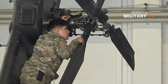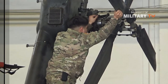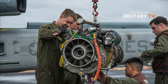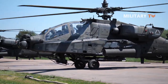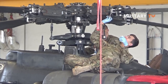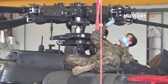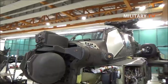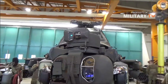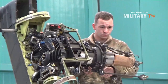An Apache has double tail rotors, each with two blades. The newest Apache sports twin General Electric T700-GE-701C turboshaft engines, boasting about 1,700 horsepower each. Each engine turns a drive shaft, which is connected to a simple gearbox. The gearbox shifts the angle of rotation about 90 degrees and passes the power onto the transmission, which transmits the power to the main rotor assembly and a long shaft leading to the tail rotor.